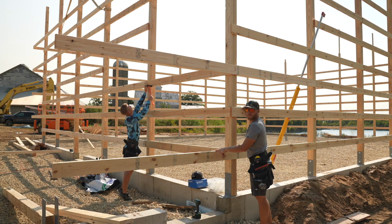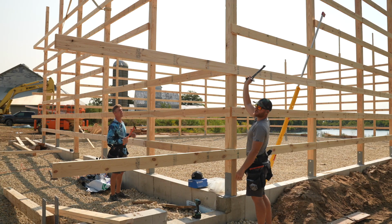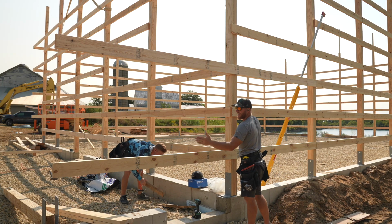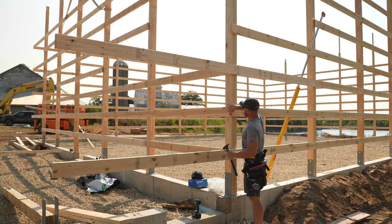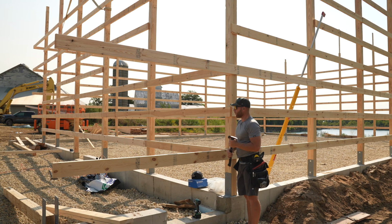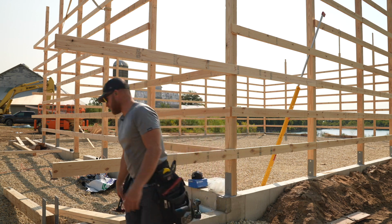So one thing you'll see here is a little bit different is our girts here are gonna run past. This wall here is gonna be a 9-foot wall, so these first couple girt rows are gonna just continue all the way through. We had to do something to tie this together. So we treated this building like its own complete building, and we're just gonna attach the garage to it. But we thought for strength, might as well run these first couple through. This is gonna be completely sheathed anyway, so I'm not worried about it. But if you're looking at this wondering what's going on, we're going to run a 2x6 ledger up. I don't know if you call it a ledger, but basically a fake post up against this. And that is where these girts will die into. And then also on the interior, it'll give something for the interior to be connected as well. We just figured we might as well run these through and make it as strong as possible. I don't know, seemed like the right thing to do.